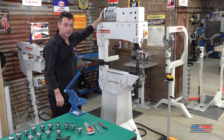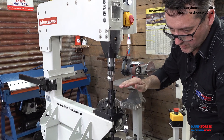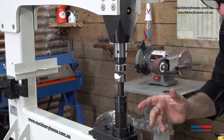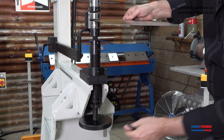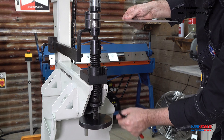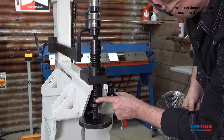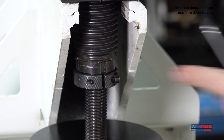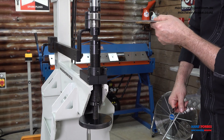We have an adjustable hand wheel to control the stroke so that when you set your tooling clearance, you'll get it perfect. When setting the clearance on our tooling, we need to make sure that we've got slightly less than material thickness so the radial or lineal stretching dies work correctly. With the top planishing hammer set on the bottom of its stroke, you can adjust your lower wheel up until you get a sliding clearance. You then adjust this C-spanner nut until that locks, then lock off the knurled jam nut on the bottom, and that way you've got the correct clearance for your material.